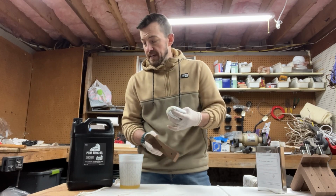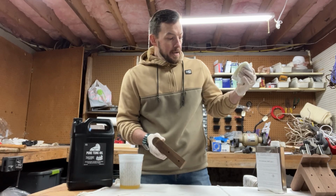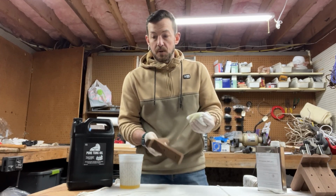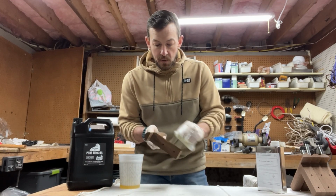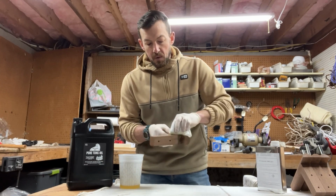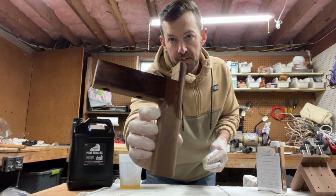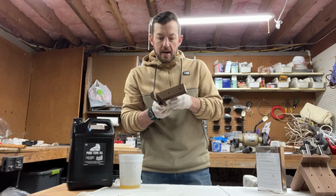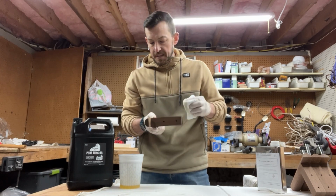So all I have done here is I have 50% tung oil here and the D-limonene. So I'd like to just show you real quick. All I did was dip this in the rag. This actually will go on very, very quickly, but you can see in a very quick and immediate way a really good idea about how dark the finish is actually going to come out on this piece. And so I'm just going to go ahead and wipe all of these legs and soak this really nicely.